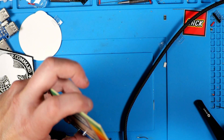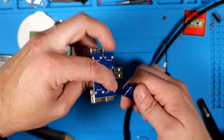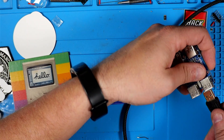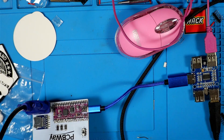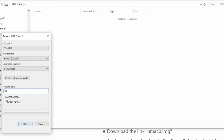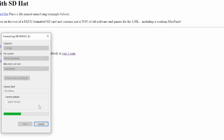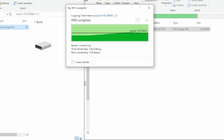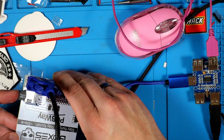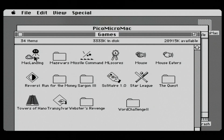Next I used the USB hub that was included to connect the keyboard and mouse, along with the On-The-Go cable. Whichever way you prefer, you want to get your mouse and keyboard hooked up and have a way to inject power since there's only one connector on the board. Then I grabbed the SD card, opened the package, stuck it in the PC, and formatted it — it came pre-formatted, but I went ahead and did a normal non-quick format just to be safe. Then I copied the previously downloaded image over to the SD card and stuck it into the board.